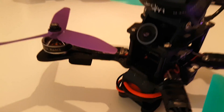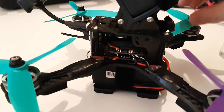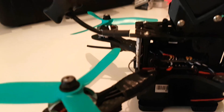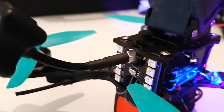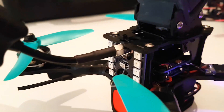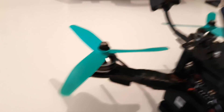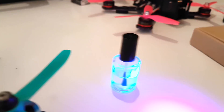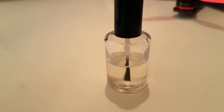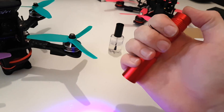I've also heat-shrunk over some of it and put electrical tape over the ESCs. Everything — the PDB, ESCs, flight controller, receiver, even the board inside the camera — has been conformal coated. The GoPro Session is waterproof as stock. The conformal coating just goes on like nail polish, goes on clear, and lights up under UV. It's really good to have a UV torch so you can see if you've missed spots.